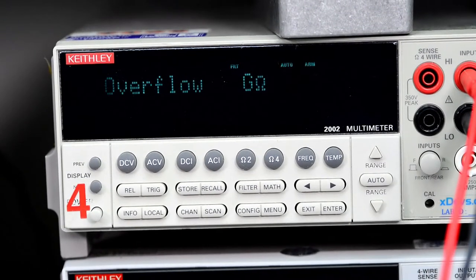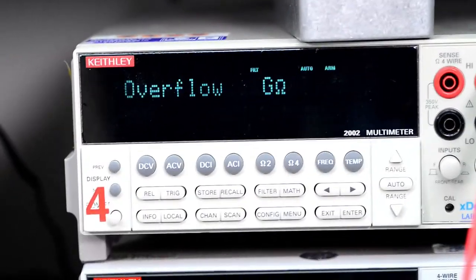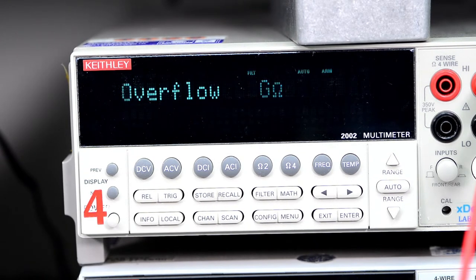Where's my meter? There we go. Is there enough voltage in there to damage the 10 kilo ohm? Well, the supply voltage for that op amp is plus minus 15 volts, so in theory we can have up to 30 volts. And that is probably not enough to burn the 10 kilo ohms, but I'd say that can give more power than they would be very happy with.